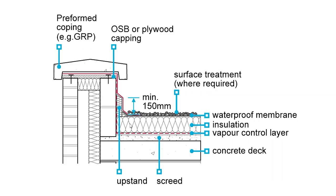If you use something like insulated blocks, then obviously that cold bridging would be reduced greatly. Now here it's interesting because what they've done is run that bit of insulation up the edge of the wall to keep that bit of wall warmer. That seems a bit odd to me, because you've got your bit of cold bridging, you've got that cold wall, you've warmed it up, you've left that bit uninsulated, and you've got this awkward little spot on the wall where it kicks out.